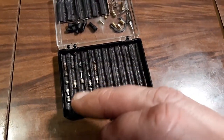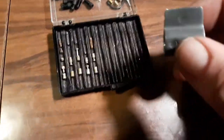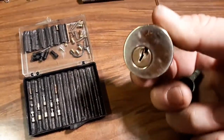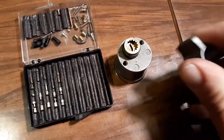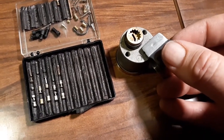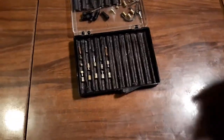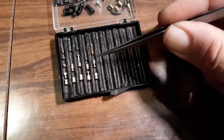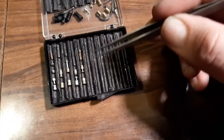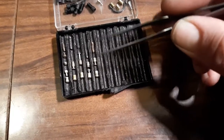When you have a plug follower this short, it really limits you. I'd recommend doing something like that. The difference in the top is huge — I'm having to cut springs into thirds and halves for some of this stuff. Also, if you've got some crazy driver pins, think about your spring height and your tensions. If you want something to be hard to set and it's serrated, put a thick spring in there, or maybe a thin one.